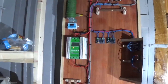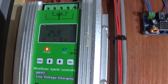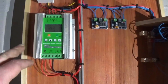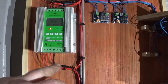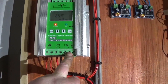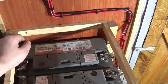I did buy a hybrid solar wind charger — you can see it is now charging at 25.9 volts. The idea of these boxes is you can put wind and solar into it and it will give you a nice clean DC output to charge your batteries. It will also give you a protected lighting circuit, but this is quite weak. The idea is that it will switch off when the battery voltage goes below 20.4 volts — for a 24 volt battery that's when you want to switch off.